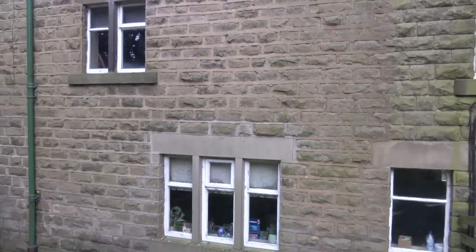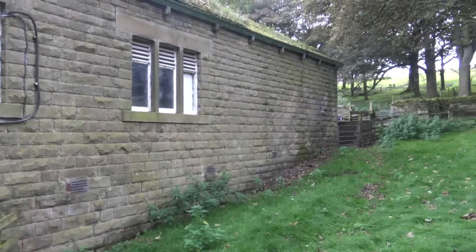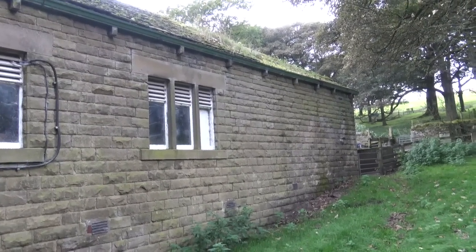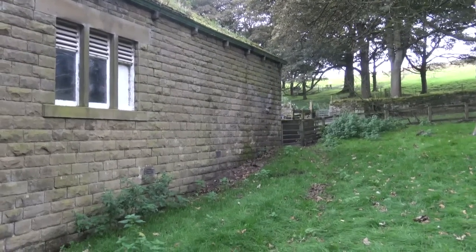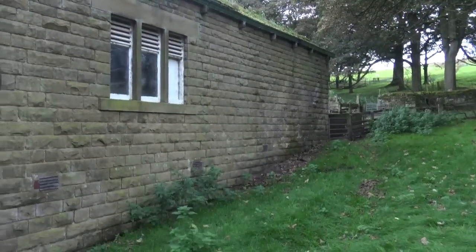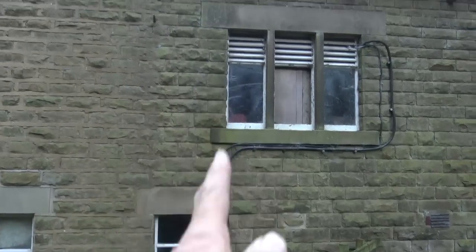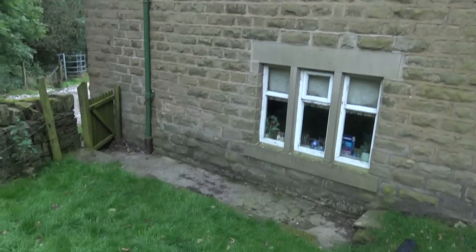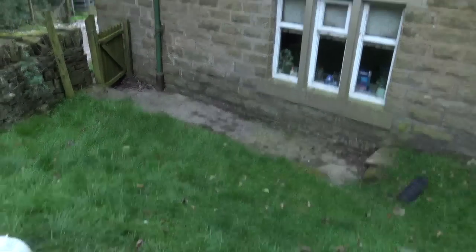So what are we looking at? We've got a stone wall. I don't know if anybody noticed any difference here, but apart from the fact the gutters are all blocked — and you can see that wherever the gutters are blocked there's kind of like a bit running down the wall. So we've got lots of water, a bit more coming down there, and you can see the gap in the gutter. And there's another bit just down there — you can see there's a gutter above it.